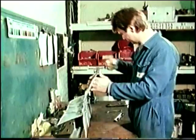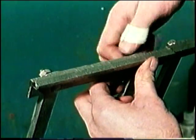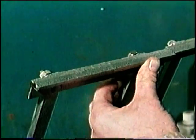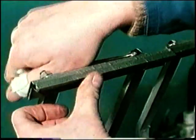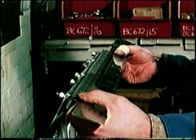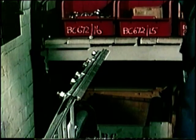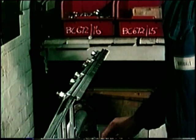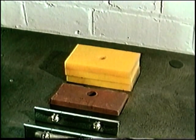Blade tips are easily replaced and are maintenance-free, right up to the point when blade wear reaches replacement level. A minimum of downtime is required to refurbish any belt cleaner. The blades are aligned alongside each other so as to present a continuous, efficient scraping angle throughout its operating life. A range of blades for all applications are available.